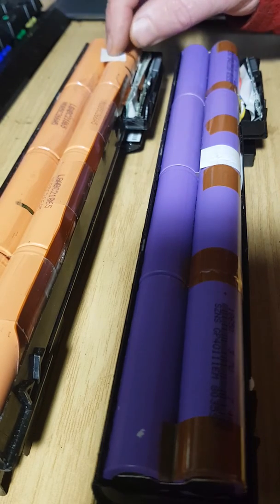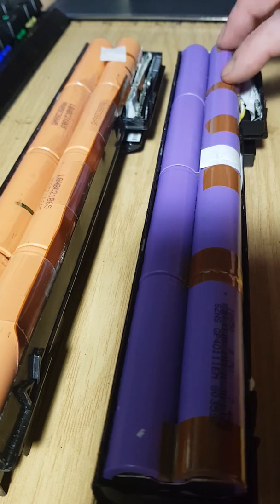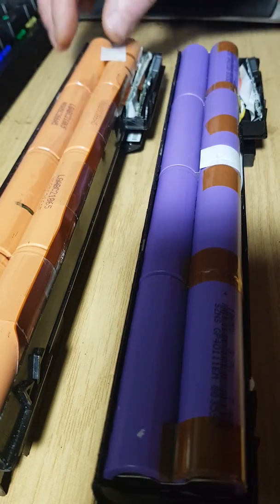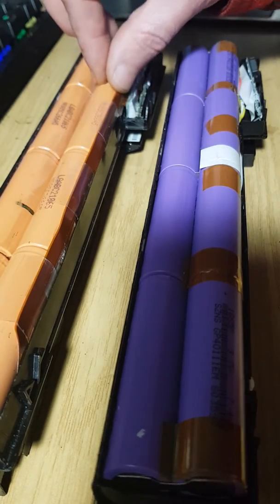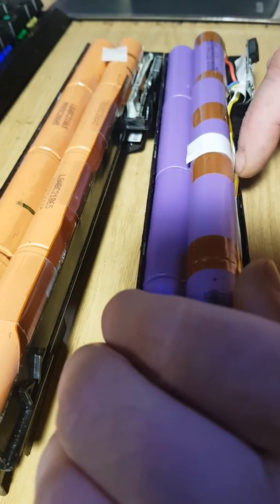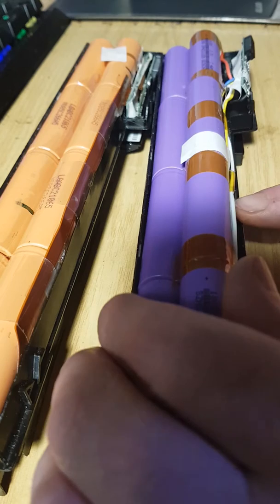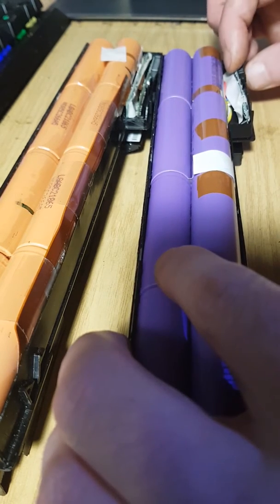But as you can see, this has a thermal protection circuit, like we mentioned earlier, which protects the temperature of the cells. These cheap Chinese ones don't have the thermal protection circuit. Also, if you look, the HP ones are slightly better built, because they have a much wider strip on. These ones here have thin temperature resistant silicone wires. It's been known before that there are very few strands of copper inside these wires, so there's no way this cell would handle any considerable current.